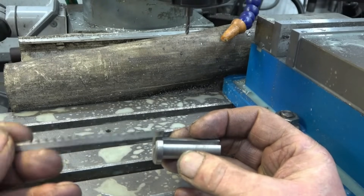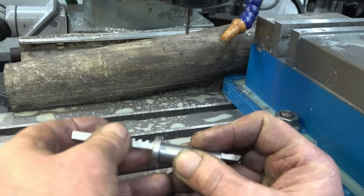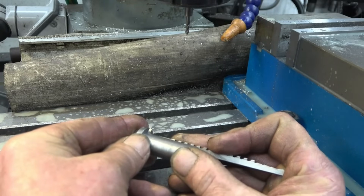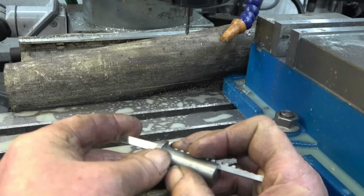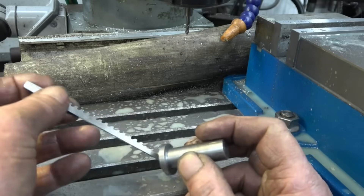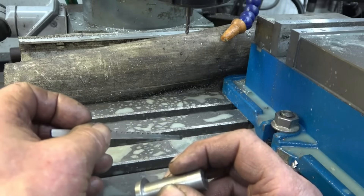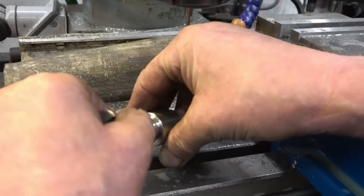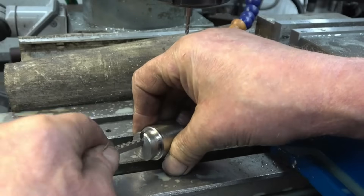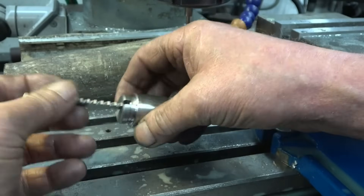I've managed to machine that without breaking the milling cutter, but it did take a long time. The broach goes into there — nice fit in the slot — and you can see all the teeth are in there. The broach advances, the teeth cut, and it starts to take a cut. So now we'll go across to the arbor press and see if we can cut the keyway. The broach has a similar life expectancy as the end mill — not a great lot. The guide slips into there and the broach goes into there; as you push it through it cuts, and then we'll put little shims in behind there just to pack it out. Easy as that.